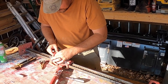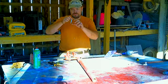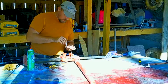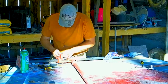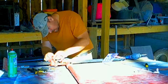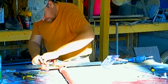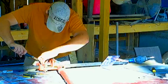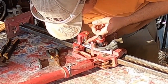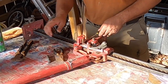I'm just gonna put my spring in place. The orientation of the pin goes like this with the diagonal on the uphill side, so the actual point is on the downhill side — this is how it's supposed to be, and this is how I have it in here. Now I get to fight this spring-loaded pin and try to get the retaining pin in. The spring needs to be on the top of the pin, not in between the pin.